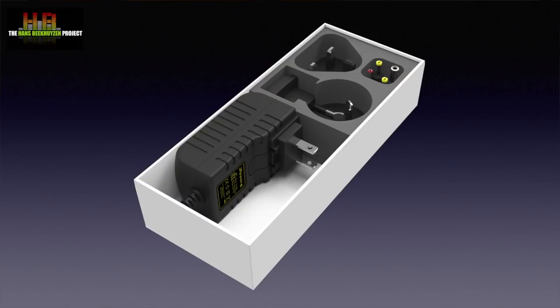Talking about power, the Nano iUSB 3.0 comes with a 9-volt iPower wall wart. This is an audio grade switching mode power supply. I have reviewed the 5-volt version to find it as good as the Audiophonics linear power supply. Apart from active noise cancellation and filtering of the power supply, the USB signal is also reclocked and regenerated.